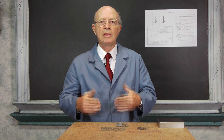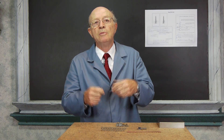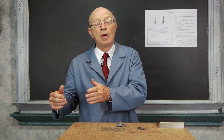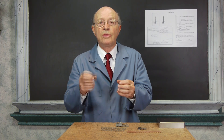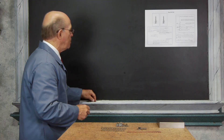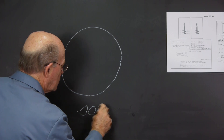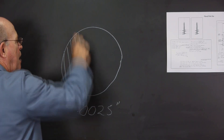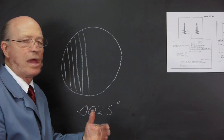In the previous video I demonstrated old-fashioned die making where we used a filing machine and hand files to make our dies. Then I left that shop, got a good raise, and went into a precision die shop where we did everything by means of form grinding. I could literally grind within one-tenth of a thousandth. To give an idea of what that is — a human hair is approximately two and a half thousandths thick. So one-tenth of a thousandth means dividing a human hair into twenty-five pieces. That gives you an idea how close I could grind on a surface grinder.